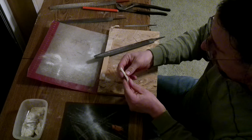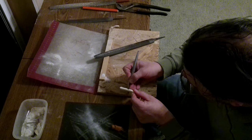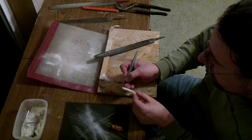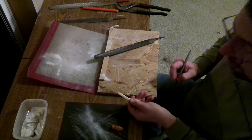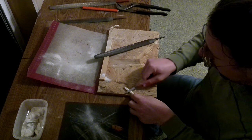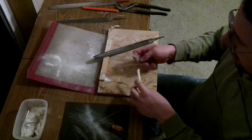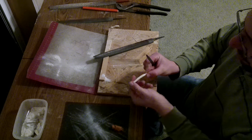This is how you control a rounded shape — I can look at the line formed by the edge of a facet and make sure it's even. I can see it's wide here and tapers off here, so making sure that line is straight is how I maintain my cross section all the way around evenly. Then once you have those lines, you come back and just turn it and take all the corners off. I'm going to work on getting this to an octagon and getting these ends squared off, then we'll come back and do the final steps.